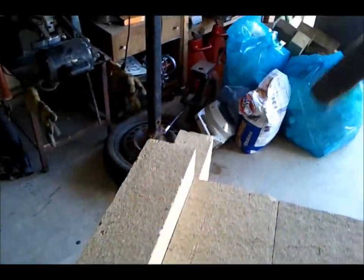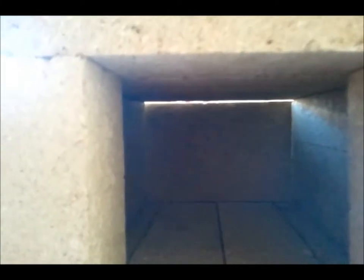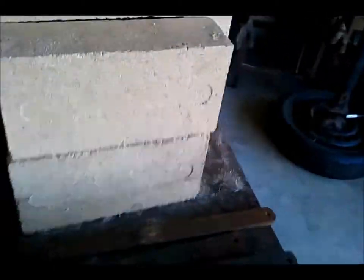This is basically going to go in through the top, between these two bricks. I'm going to drill a hole that will shoot right down into this cavity here. I plan on leaving these bricks movable so that I can open it to make it wider, or maybe if you're working on just a really narrow piece of metal you need to close it off and it'll keep it hotter. Also, this back brick I'm going to leave movable — you can put spacers under it so that if you have something longer it can stick out the back of the forge.